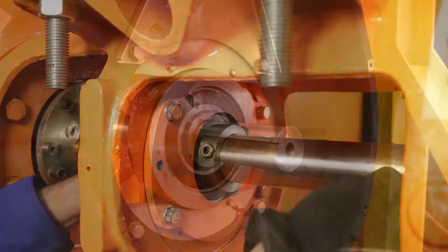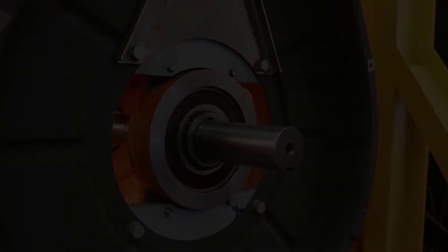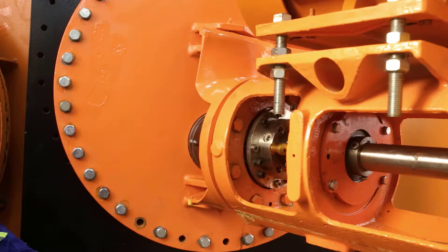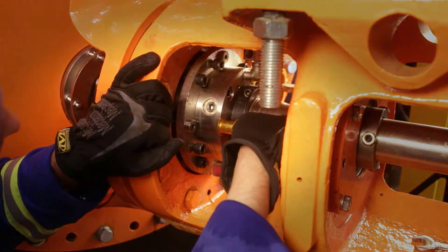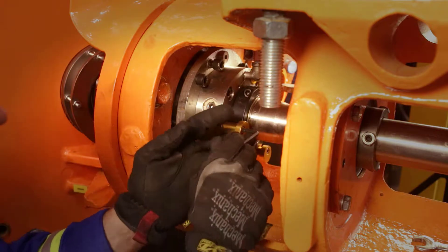When the set screws are loose, set the key away in the back so it faces down. Next, install the setting tabs and loosen the clamp collar on the mechanical seal. Some of our mechanical seal setting tabs work differently from this. Determine what setting tabs and locking device your seal has. This one happens to be a Philadelphia Mixing Solutions standard mechanical seal.